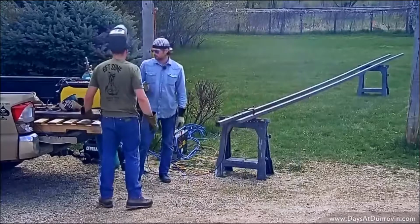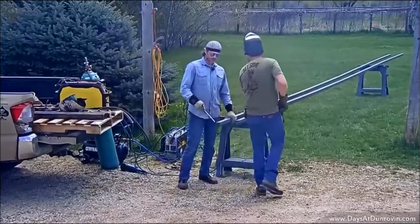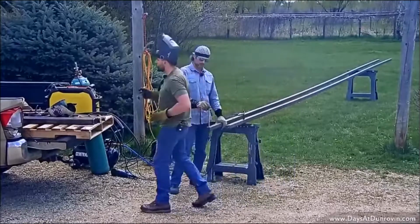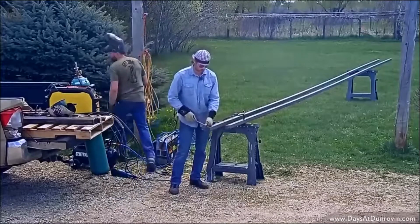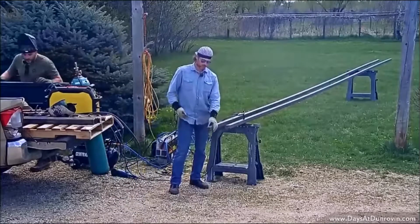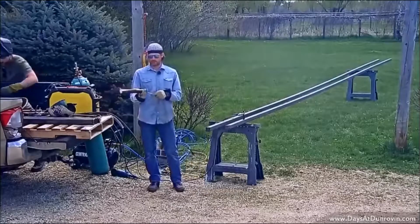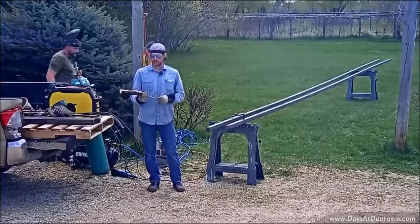Yeah, so half an inch, or? Yeah, let's mark it off. We're gonna, from top of steel, we're gonna mark 1 inch down, center it on here. We're gonna fit these on, make sure they're nice and square. A little bit of fitting work. And yeah, we'll do that, and then we'll epoxy these over the top of it, use PC7 or something like that, and birds won't be able to pick and eat at it, so that'd be good.